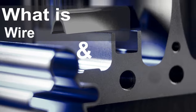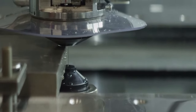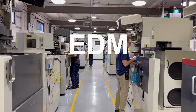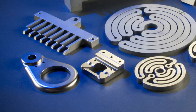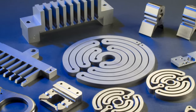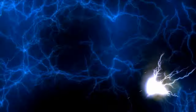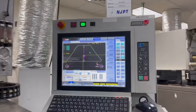What is EDM? It is one of the most precise metal removal processes used today for prototype and production. EDM stands for Electrical Discharge Machining. This process allows for intricate shapes to be cut through any conductive material with an electrical charge in a dielectric fluid using computerized numerical control technology, or CNC.